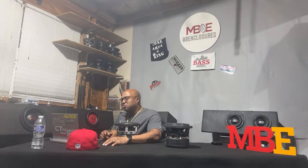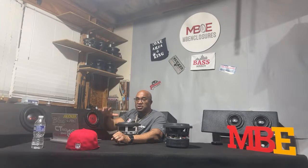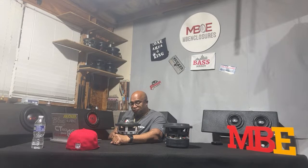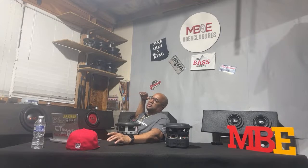You tune to 32, you're gonna lose a little bit of your highs, even though you got that same cone. The bigger the driver, the easier it is to cover all the bandwidths. The reason is because as you go below tuning, the force of the motor and the suspension itself can help it play below tuning. So I tune to 33, I still play 28, 26, and all that.